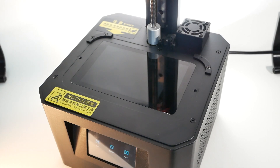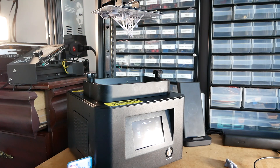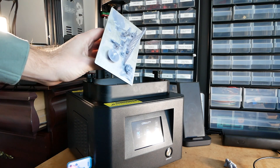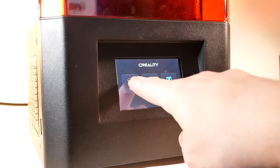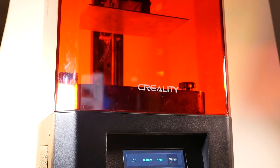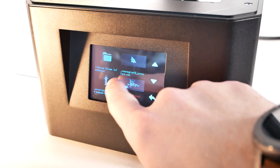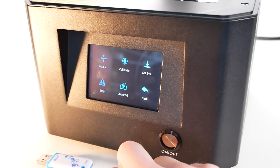The LCD display is layered on top of a UV light which uses 405 nanometer UV light to cure photosensitive resin — that's SLA printing in essence. It's a very simple printer to use; the leveling takes a couple of moments and once done it's pretty much set and forget. All you have to do is stick the USB drive in with your design, press print, and wait a couple of hours. The printer isn't particularly loud and even the smell of the resin, using Anycubic resin in a ventilated area, wasn't that terrible.